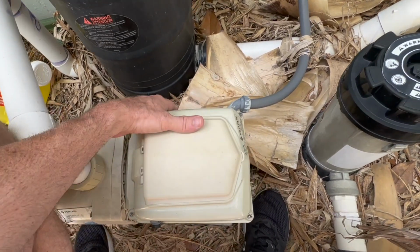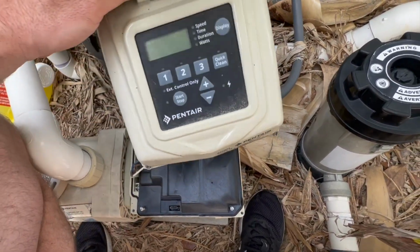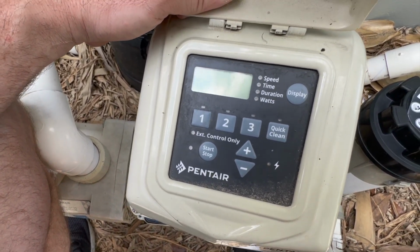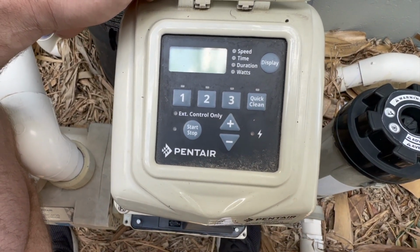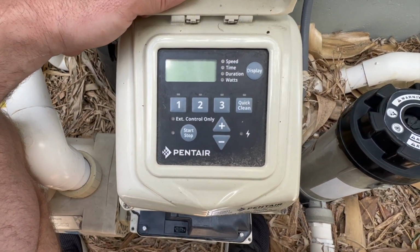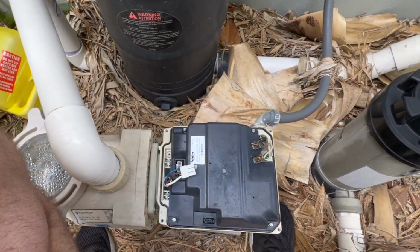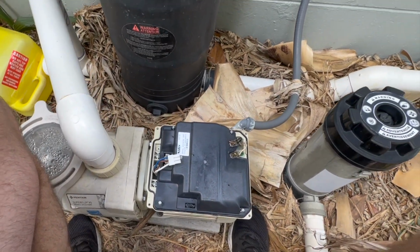And then I also took my meter and tested for power. You can't always trust the cover kit here, because the cover on these has the little symbol there for whether or not this has power. Mine had power, and that was off because of the problems that it was having in the drive. So don't just trust there. Actually take your meter and test, make sure your power is off and that you're safe to get started.